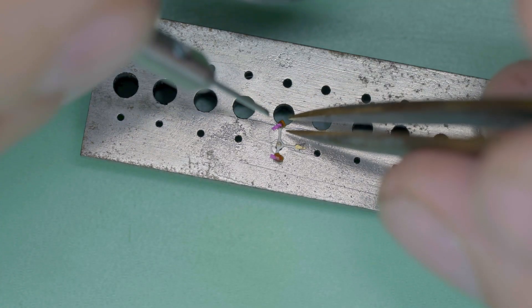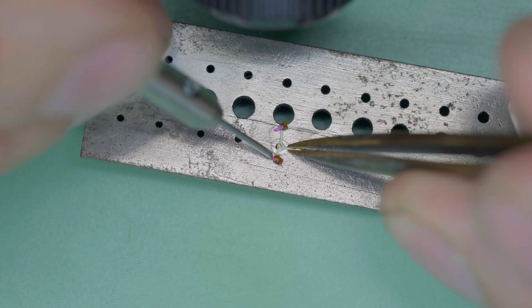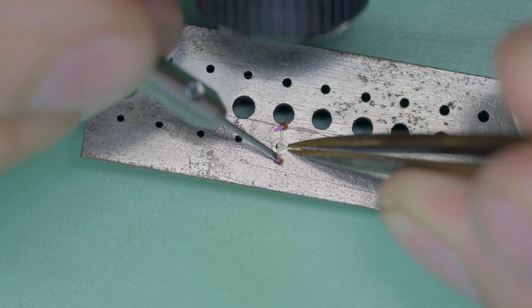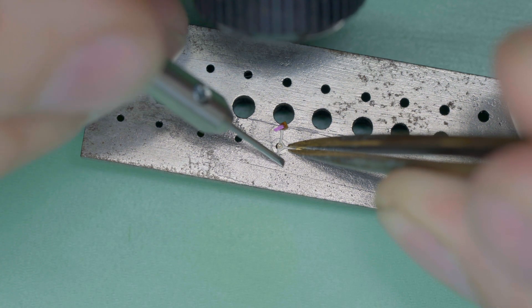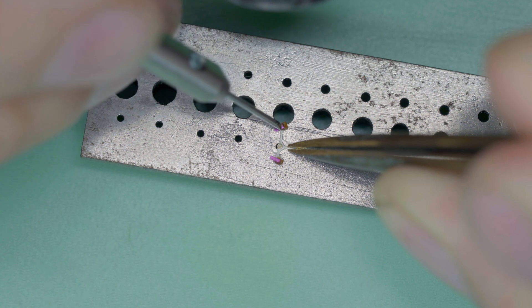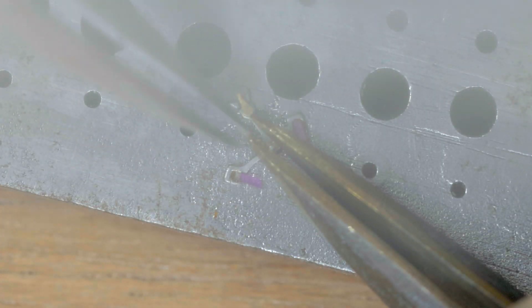So I removed the bulk of the old shellac and prepared to reapply new shellac, and that's when I hit upon a problem. I searched high and low but I could not find my pallet warmer. A pallet warmer allows you to heat up the pallets and shellac in a controlled manner so as to reduce the potential for damage by overheating. So I decided to make a new one — I'm not a machinist, but a pallet warmer is not really a complicated tool either.